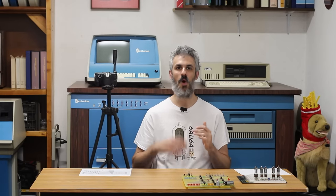That is all eight of our inputs from our paper tape. Because we send the input through an inverter and then buffer it, everything is backwards — but that means the inverters look like they're doing what they're supposed to do. To test all the inverter buffers, I'm just going to take a high-level input on this jumper cable and swipe it right across the eight input pins. As the cable makes contact with an input pin, that high-level input will pull the inverter low, which should turn off the appropriate VFD. Touching the first one — yep, that's awesome, it kicks on and off. Going down the list — they all turn on and off perfectly. That's really cool.